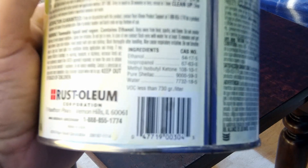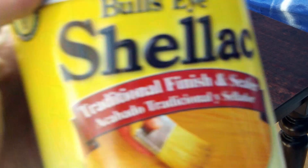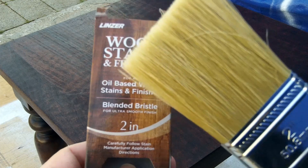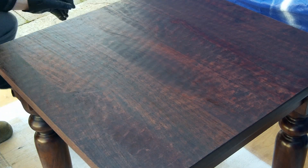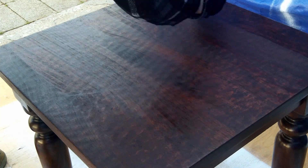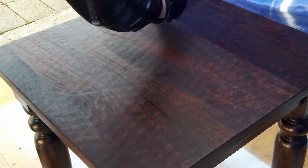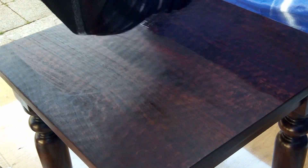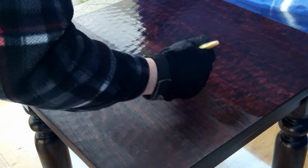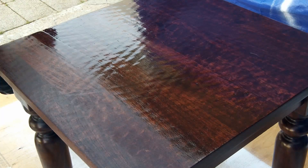Now I'm going to show you the shellac I'm using — it's Bullseye by Rust-Oleum, clear transparent. I have a specific natural hair brush that I'm going to be using, because it's extremely important to get the best brush you can for applying the top coat sealer when sealing wood stains. I do admit that putting on this shellac ends up being sticky if you go back over brush strokes again, so you want to get it on nice and smooth. The type of brush you're using is most definitely going to be important.